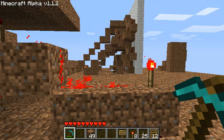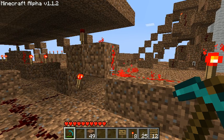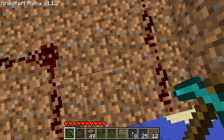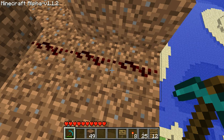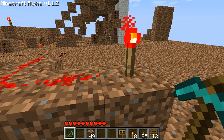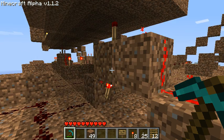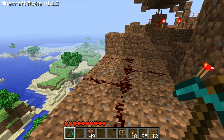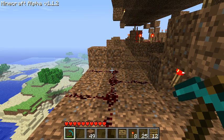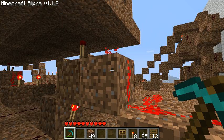What we're looking at right now is the gate that activates the number 1 on the display. 1 in binary is 0, 0, 0, 1. This gate will only be active if there is an input on the first bit. Being an AND gate with an inverter thrown in, these three bits have to be off. If any of those three bits are on, you obviously don't have one — it disables the gate and a different number is displayed.